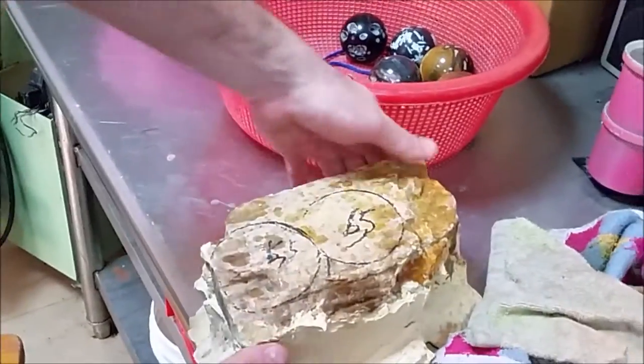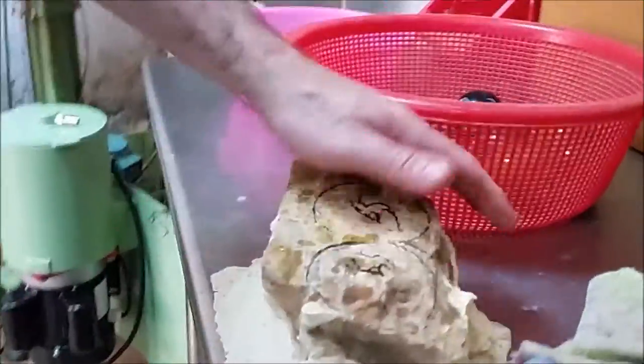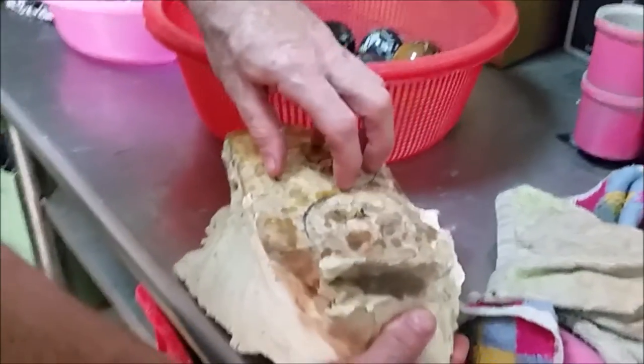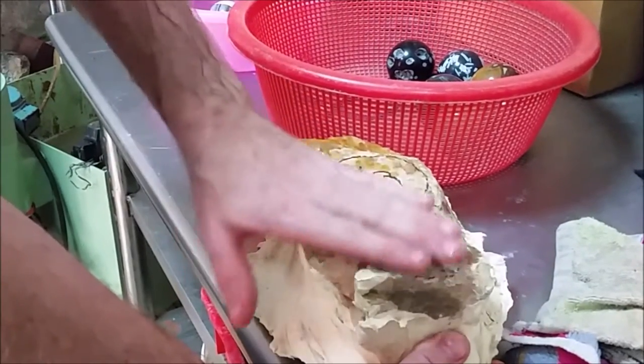Now this one here isn't cast quite right because it's a little bit on the angle. It would have been better cast sitting flat across the top, because when your bit comes in, it's much easier to get to high speed — you can crank the feed up if it's flat.